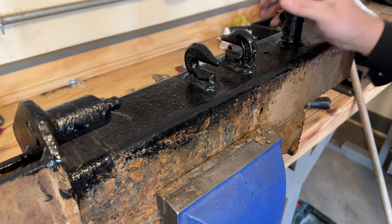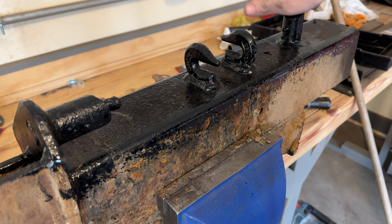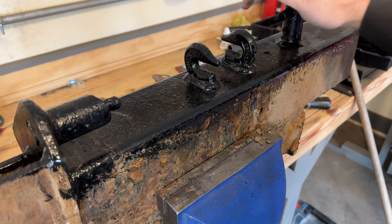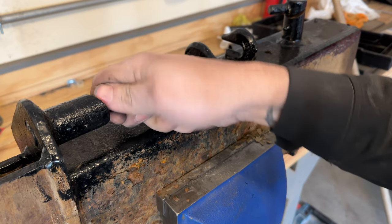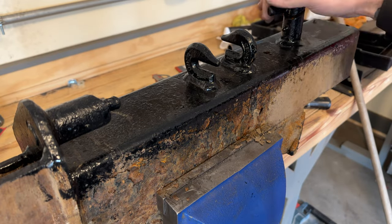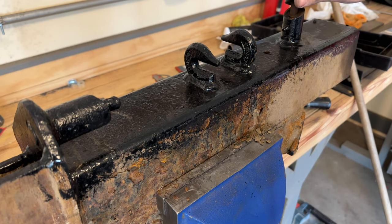What's up YouTubers, got a fun probably pretty quick repair here. I have part of a tow truck — these things have captive held pins, so it locks something that slides in very easily so you don't have to mess with hitch pins. This one works, but this one the handle broke off. The shaft that puts the pin through is likely seized up, and I can imagine why — there are grease fittings here that are covered with paint. These things probably just don't get greased. Pretty rusty — very common. You want to grease these so they don't bind up.